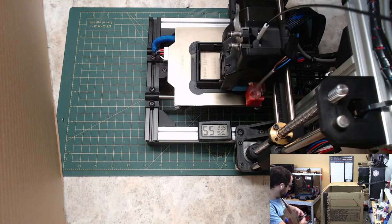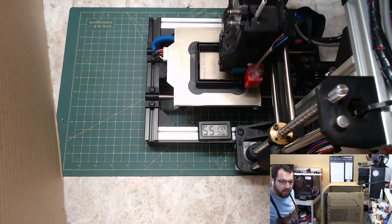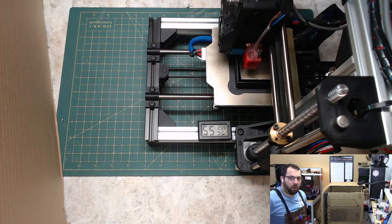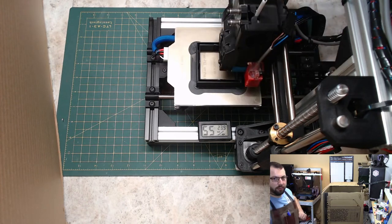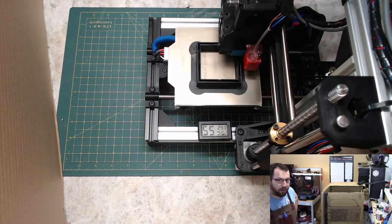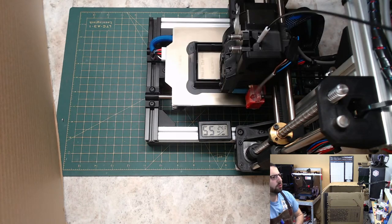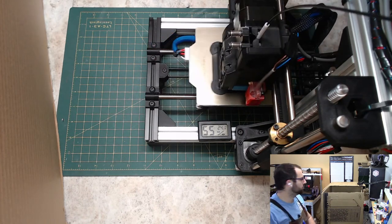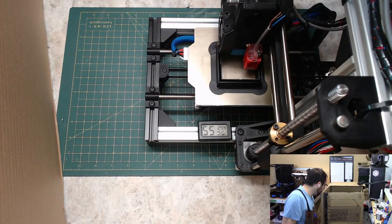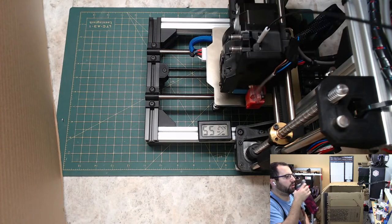Yeah, threaded rod for an axis was fine back in, you know, 19-dickety-2 when people were using nylon weed whacker line, but it's the future now. We should be using better equipment. Well, we're not having layer separation, so that's good. So yeah, bumping it up to 3 walls was definitely what we needed to do.